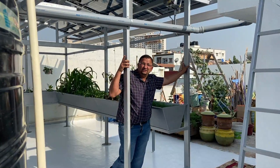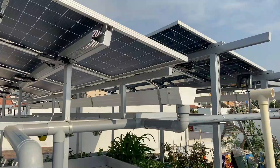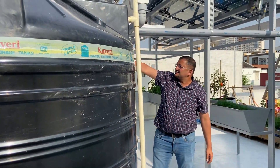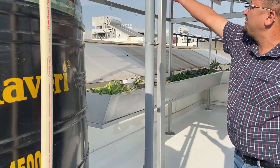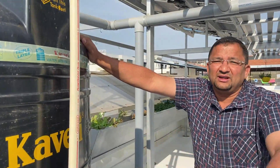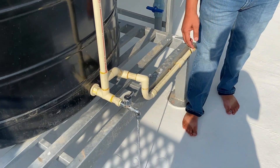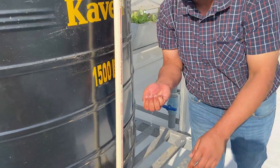This is the other side of the structure. As I mentioned from the top, there are two gutters on either side. The rainwater falling on the solar panels gets into those gutters and is collected into this tank. A small rudimentary filtration is provided here so that the first few minutes of rain can be diverted outside. After this column fills up, the water gets stored in the tank and is connected into the house for all purposes. We actually had rain last night, so this is the water collected from the solar panels from yesterday's rain — good, clean, sweet water. Rainwater is the cleanest source of water.